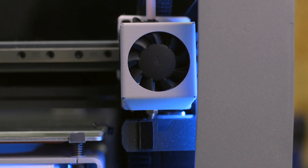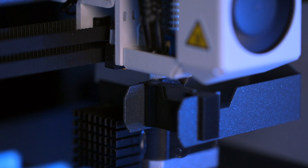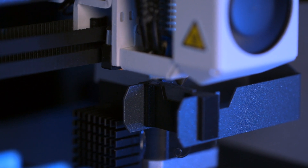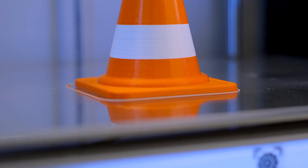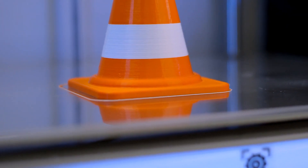With IDEX, cross-contamination of materials isn't a concern because the unused print head simply parks off to the side and is brought in when needed, so there is never any fear that a potentially oozing nozzle will smear into the in-progress 3D print. You don't have to worry about flecks of orange filament in your clean white stripes of your traffic cone model, or bits of dissolvable support in the walls of a model leaving voids when the supports are dissolved away. And by having two print heads, you essentially have two printers in one body, unlocking new printing modes useful for batch production: mirror mode and duplication mode.